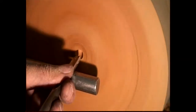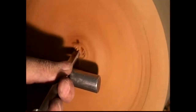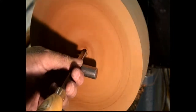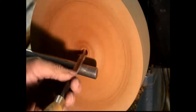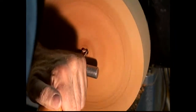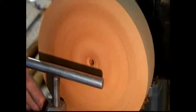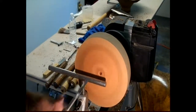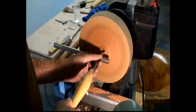And then when you put the tool back in, favor the right side of the hole. You hit the left side, especially if it's going a little faster, it'll really grab your tool. So favor the right, get it in, push it in and out. And then once you're getting in there, you can tell if it's just a tiny bit high, because it'll kind of stop going in. And if it's too low, your tool's going to be bouncing around like that.